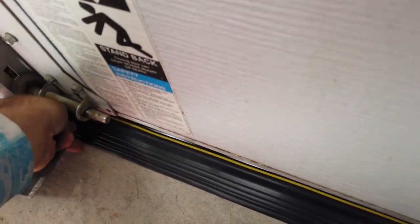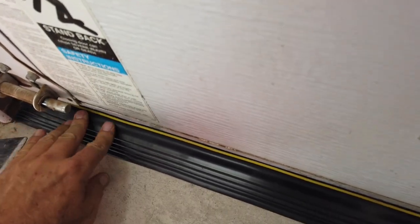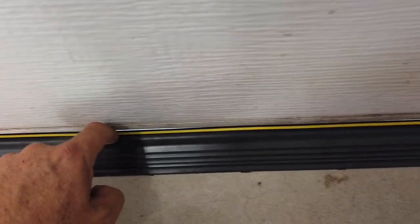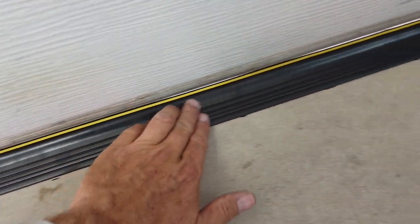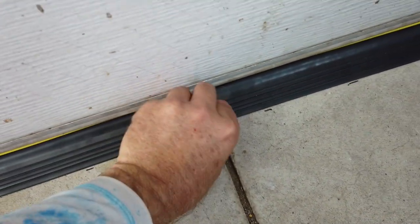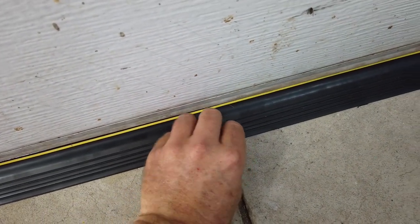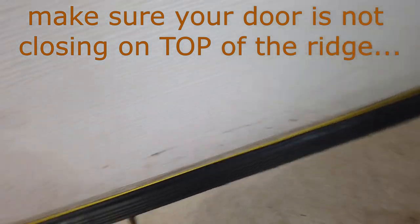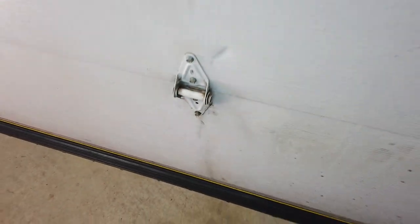What I'm going to do here is line it up so that this yellow line is consistently across the bottom of the garage door. Now, is my garage door straight? I don't know. It doesn't matter because even if the garage door is crooked, the seal kind of needs to match that. So we'll push it in or pull it out so it matches. I've already made marks in here — I got it nice and straight, using a black Sharpie with intermittent marks. They say to use a pencil and just go ahead and mark the inside and the outside.